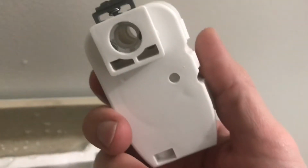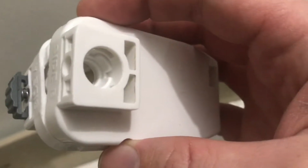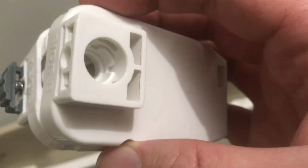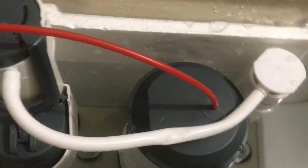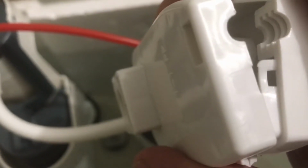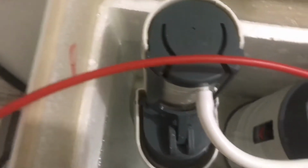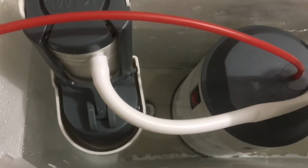Now, the instructions actually show that you click in this side right here, and on the top it says side A, and then side B. It shows in all the instructions for this thing that there should be a hose that actually connects into it on this side, and then when you twist it, that's what pulls that cord. But they've somehow got a second system in here where it gets installed into the bottom here, and I'm going to have to try and install it again. You can see that there's the 3 grooves on this thing to match the 3 little grooves in here. But I really think that Pfister has made the cable on these Fullerton toilets too short, and it has been pulling up ever so slightly on the gasket and not creating a perfect seal.